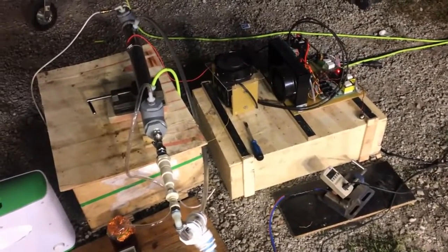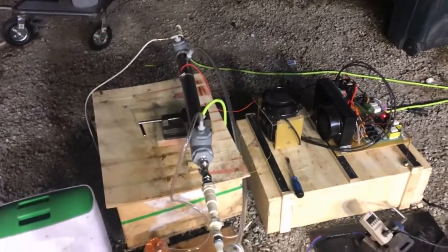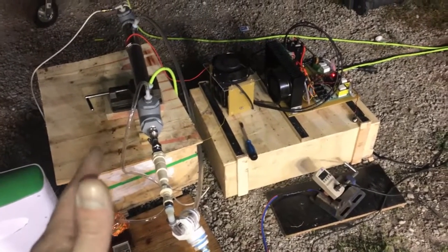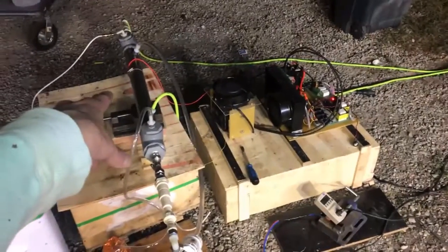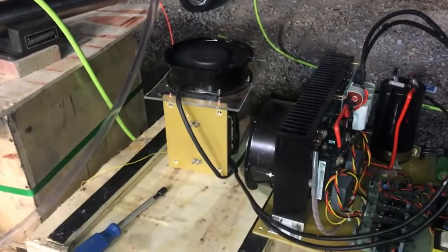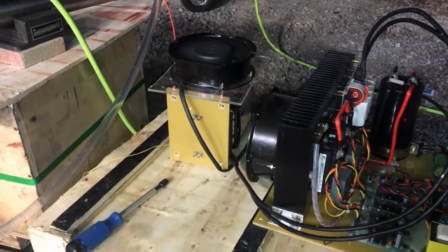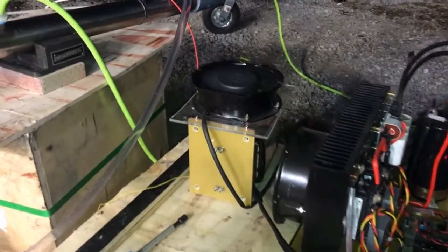As far as making these electrodes longer, the test I've done did not work out well. I don't know how well we're going to be able to pull that off because we need a higher frequency to resonate with a larger electrode. I am a little worried about the transformer — my oil tank isn't here yet. They told me it needs to be in an oil tank when running at 14 kilovolts, but I kind of think they lied — a gap test proved it's likely just the 10 kilovolt transformer.